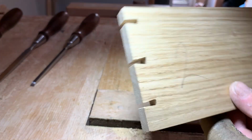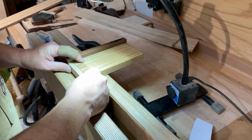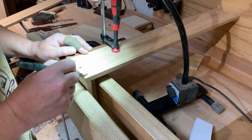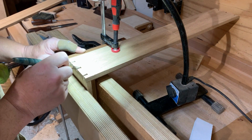I need to transfer the dovetails onto the pins first. I like to use this dovetail lining up board that I made. It just makes life a lot easier. Why struggle? The Swan Morton 01 blades on your marking knife make marking out these pins really easy.